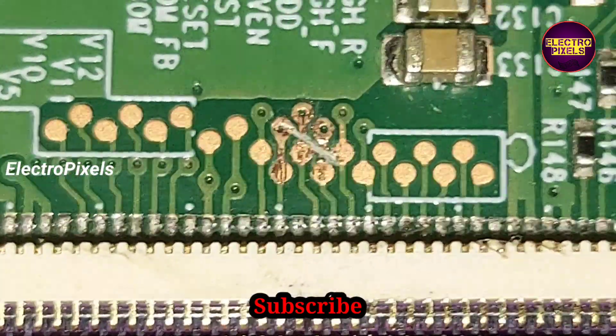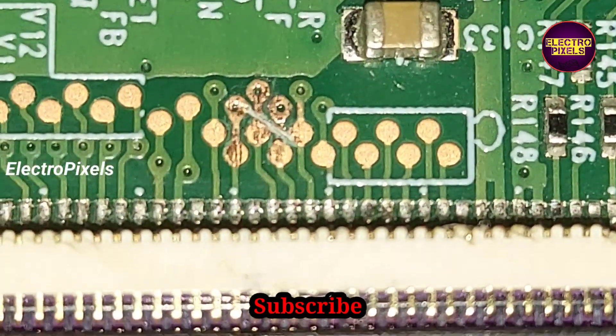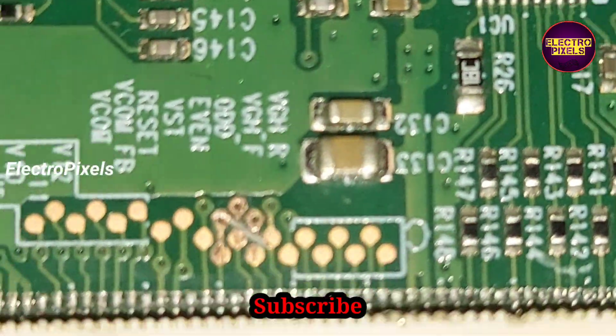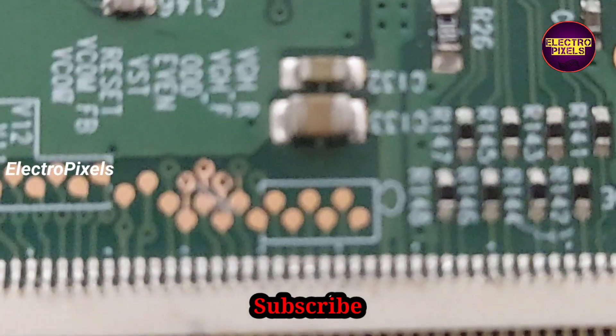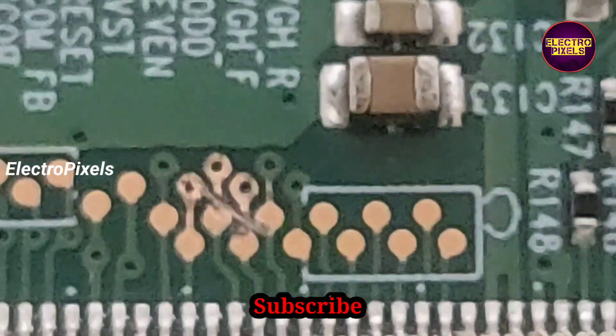So these are the tracks that we need to cut down. After cutting down the VGH_ODE and VGH_G1 tracks from the level shifter IC, on the panel side we can one by one connect VGH voltage to VGH_ODE and check if the picture is okay or not. If picture is okay, do nothing. If not okay, connect VGH to VGH_G1 instead of VGH_ODE and check the picture.